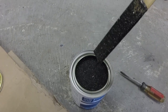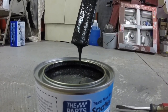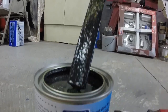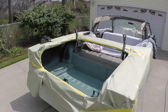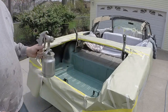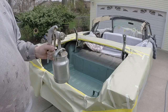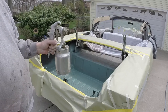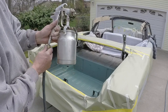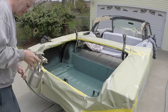You can see how thick it is. I reduced the pressure on my air hose to 40 PSI. Lacquers I like to spray at 40 with this gun, enamels at 60, and HVLP guns I usually use about 30 PSI. But you want to spray your spatter paint at lower pressure, so I set it at 40 and we'll see how it comes out and adjust the pressure from there. I got to put my mask on.